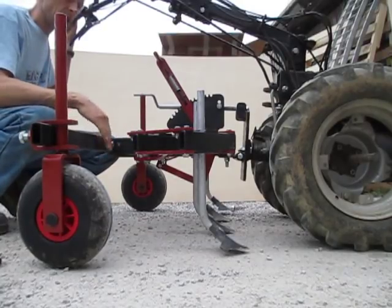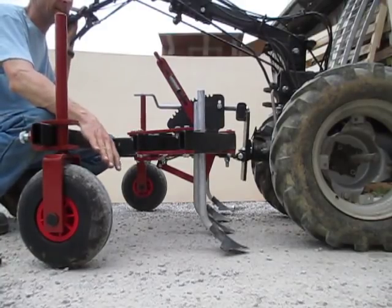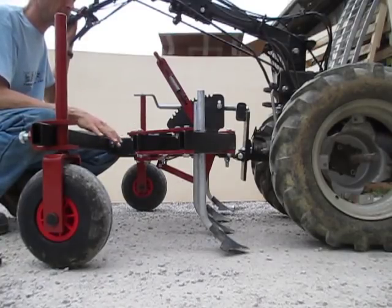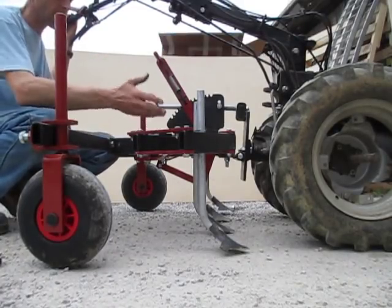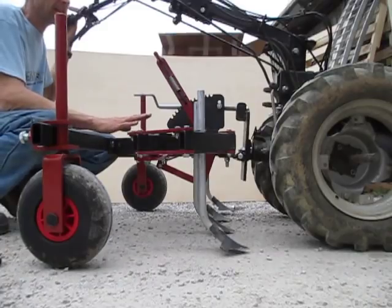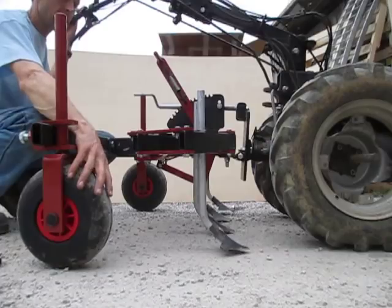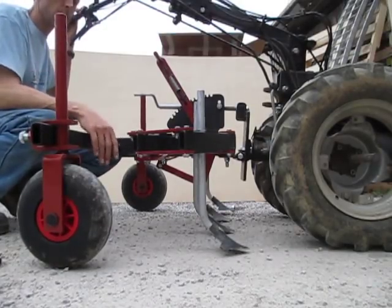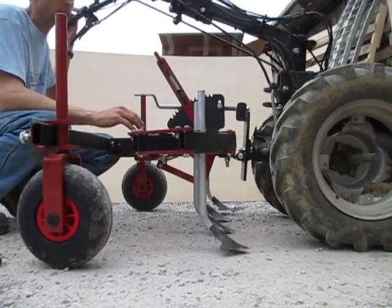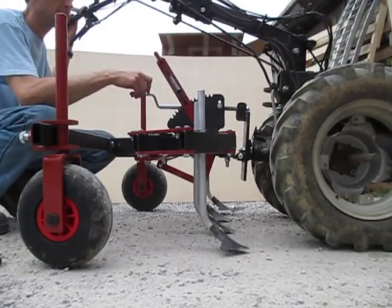The bar assembly in the rear with the gauge wheels on it can be taken off — there are two bolts holding it on. Typically you want some depth control so the wheels provide that. But if you want to lighten this thing up a little bit, you could drop this bar off and just have the skids or sweeps on the ground. You just have to watch that it doesn't go too deep. This is a fairly heavy implement, especially with the gauge wheels attached. We've selected big, solid rubber gauge wheels so they are never going to fail, but they add a little weight to the back. So to properly counterbalance this thing, we've got some Earth Tools manufactured suitcase weights on the front bumper of this BCS 749.